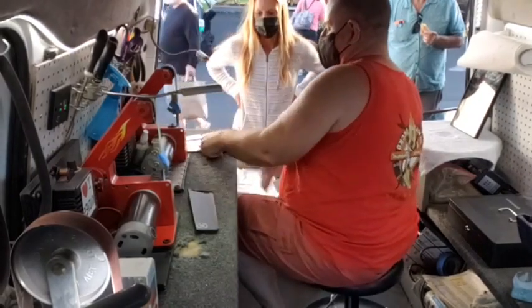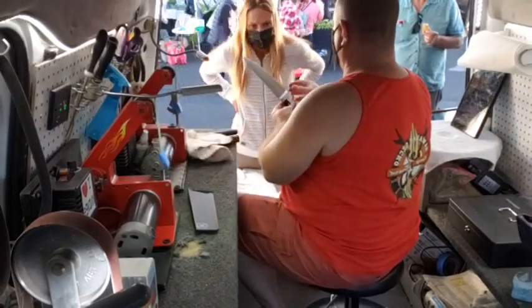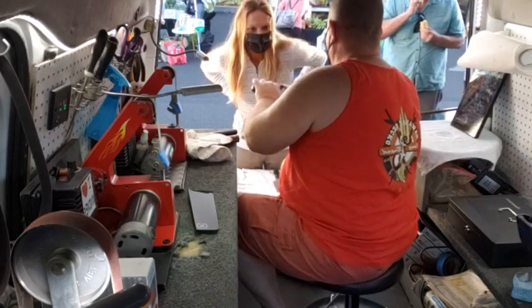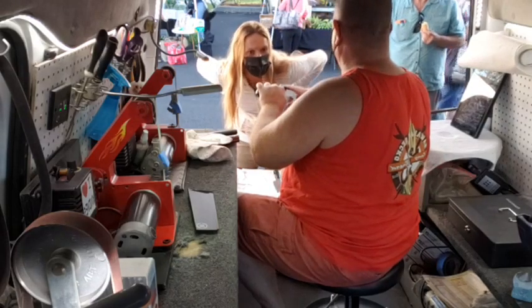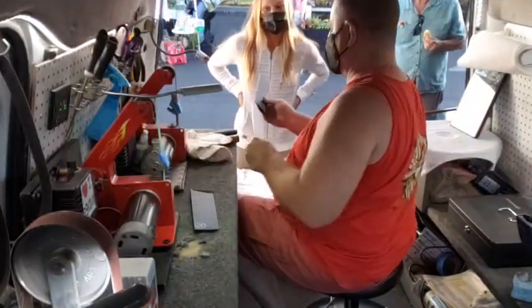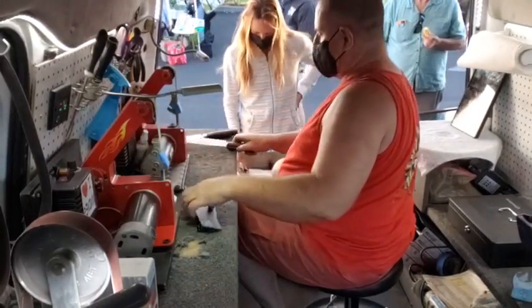You too. One of them had like a little groove in it, right? Yeah, this one had some ripples because somebody had zero ground it down to like a butterfly wing. So I just put a small micro bevel right on top at 15 degrees, and that'll help stabilize it so it won't wobble out. There literally wasn't enough material left to support the edge. Yeah, I'm telling you, these have been in the drawer for years. Thank you so much.